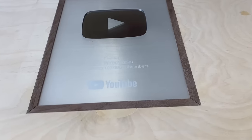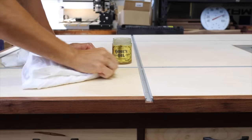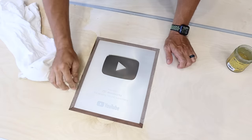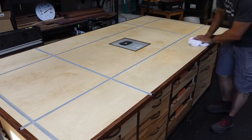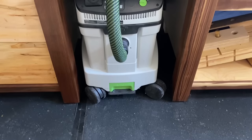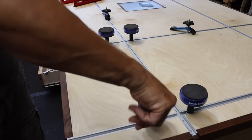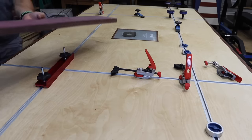One of the last steps was to apply some finish to the top. I decided to go with Odie's oil for the top — I was not happy with the Danish oil on the bottom, but I'm extremely happy with Odie's for the top. I used it on the trim as well as on the entire surface. Putting it around that play button really brings the walnut to life. You just buff off the excess and it dries really well. I actually went back and put a whole coat of it on the base too. I'm extremely biased, but I think this is the most beautiful assembly table ever created. As far as T-track accessories, I bought some Rockler hold-down clamps, Rockler bench cookies that elevate work pieces off the surface, some Armor Tool toggle clamps, as well as push clamps and fences.